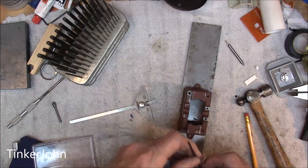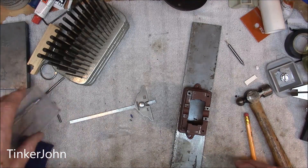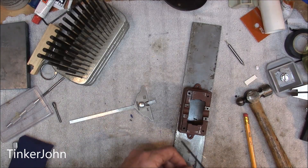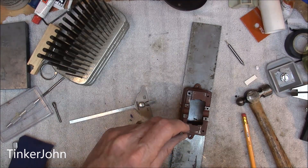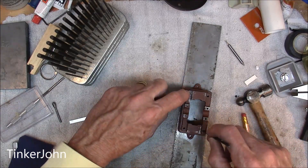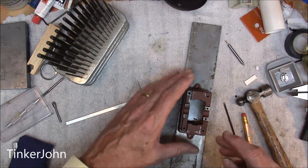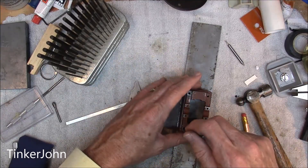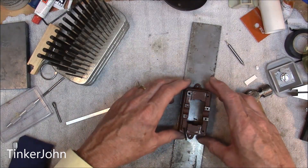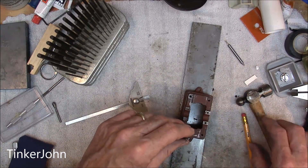I'm ready to go ahead and put a hole in it. Now, I'm not going to punch all four holes at once. I'm going to do one, then drill and tap the bottom piece, and put the bolt in it. Then I'll do the opposite corner next. When you're building this, be very careful especially if you're not using a jig. Always do one at a time when trying to get holes matched up — screw that one down good and tight, then do one more at the opposite corner, then complete it. You need two in there to make sure you've got a good line-up.